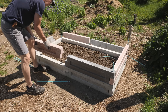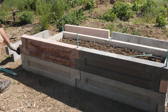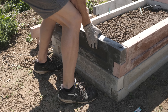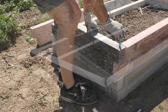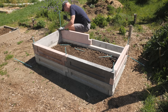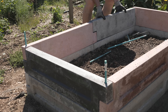I'll work my way around the bed, placing wedges, pulling short rebar, and replacing it with long ones. It's not a requirement to have the second row in lightweight concrete — I just happened to be making lightweight panels for this video. You could have your second row made from regular sand and gravel concrete if you like. I also decided to alternate the color of the second row from red to black just to see the contrast between the colors. For the last panel, I'll pull the rebar, then gently slide the panel into place.